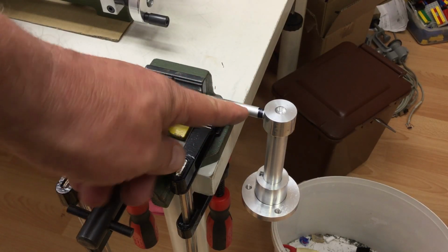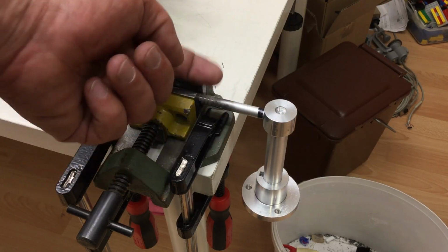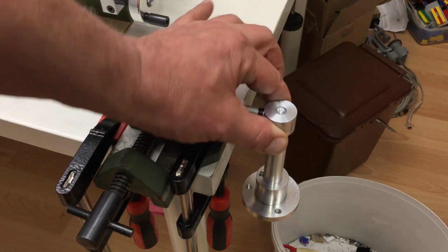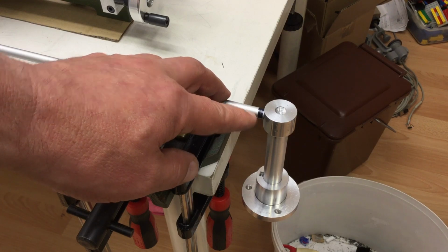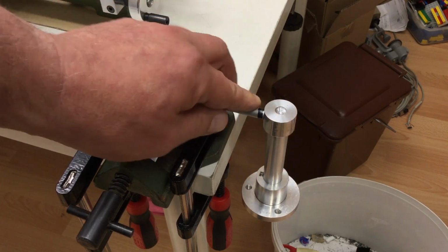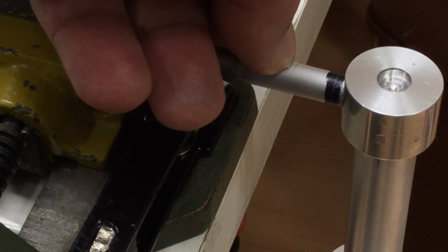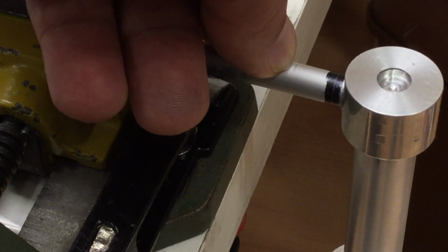Okay, I tried everything. At the very end, I tried to hammer the whole stop bolt, the raw stock, from the other end deeper in, but it's fused. It doesn't budge. I could use a heat treatment, but since the goal is to have a slight interference fit here, and we achieved that now, I will just saw it off here. I made a little marker. That's my target stick out of 13 millimeters, and then we'll try to fit that into the main body.